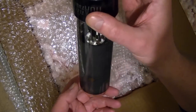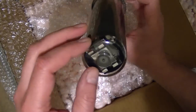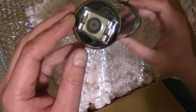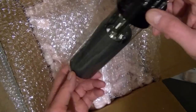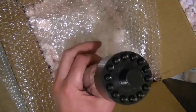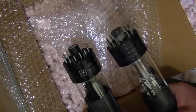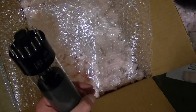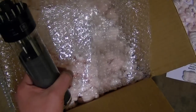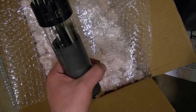I'm not sure if it's new, new old stock, or used. So what is this exactly? Well, if you ignore the front end, it's a CRT — just like something from a scope, which has the usual filament, cathode, grid, and deflection plates: two horizontal, two vertical.